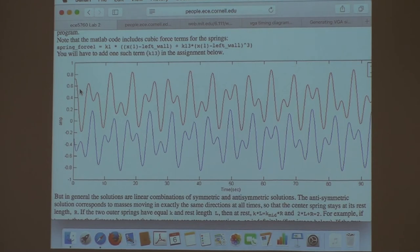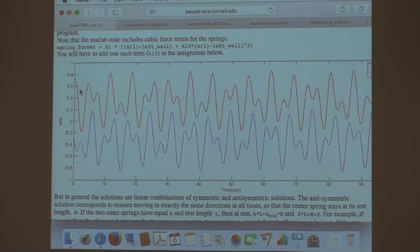So you're going to be doing a lot of calculation of intermediate results and then downsampling the simulator to put it onto the VGA. But every time you write a point, you're going to be addressing a bus master whose address is pointed at the VGA display. So that's what you're going to be doing. And what you're going to have to do is to write the simulator for this.